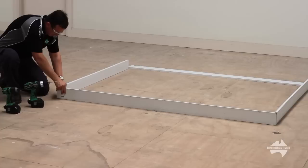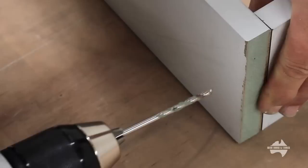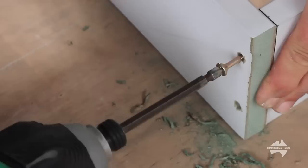Place your pre-cut flat jamb in position to assemble. Ensure the flat jamb is slightly smaller than the opening. Using a cordless drill, pre-drill pilot holes — this will help during the assembly. Now insert screws and repeat for all four corners.